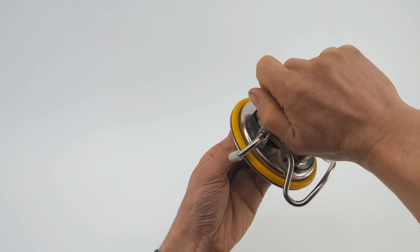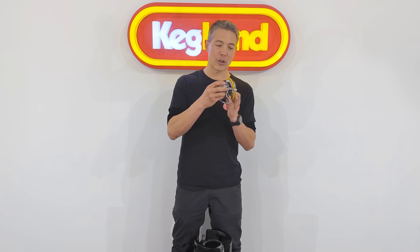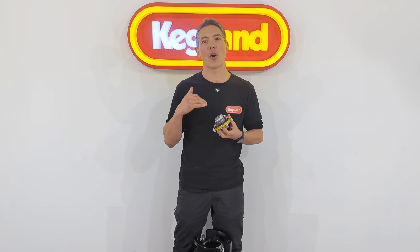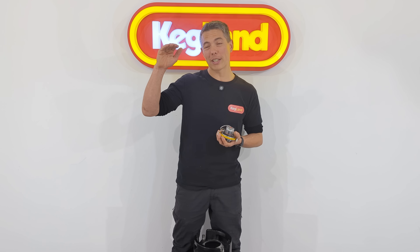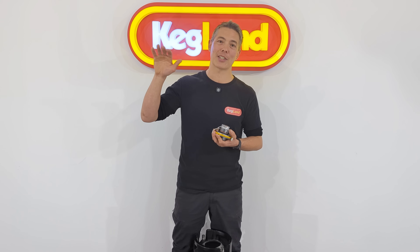This is a battery-powered device. It would be a massive pain if the unit only lasted a few weeks or a month, since a lot of you just want to set and forget. So with this unit you put some batteries in and it'll get you between 18 to 36 months, depending on your transmission frequency and the strength of Bluetooth transmissions needed — and that's only at this stage. We're also doing ongoing work at the software level to optimize power consumption. For something like a water tank where liquid levels change very slowly, you can drop the transmission frequency down even further and make it last for several years.